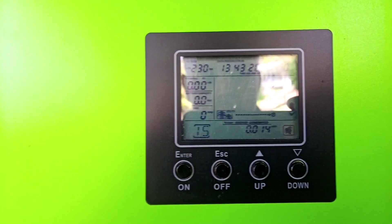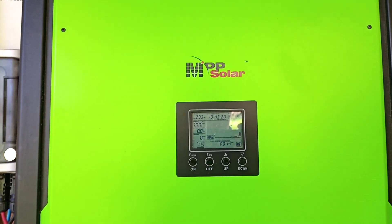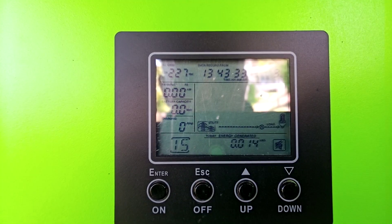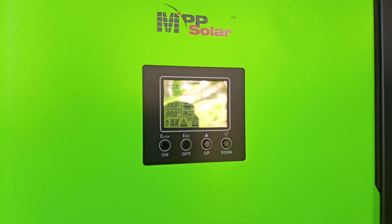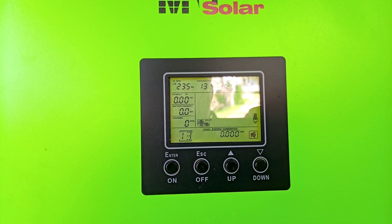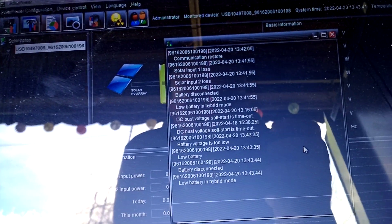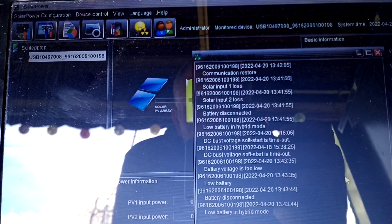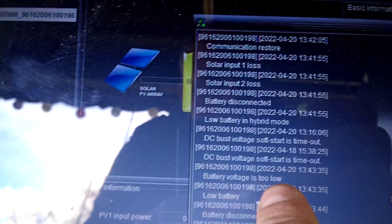Just with grid connected. Oh — click. What's this? Just a relay or two. Just warning 15: no battery. Grid is okay. Restart. Warning messages are the same. This is new: DC bus voltage soft start timeout — two times. Battery disconnected. Solar input disconnected.